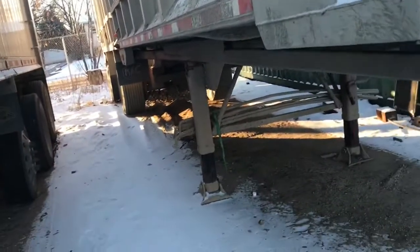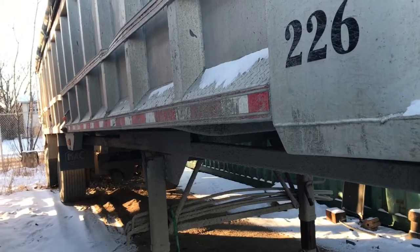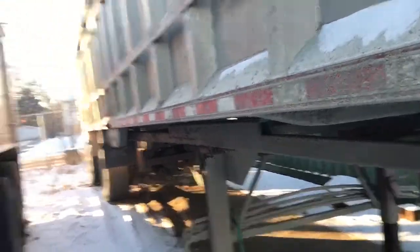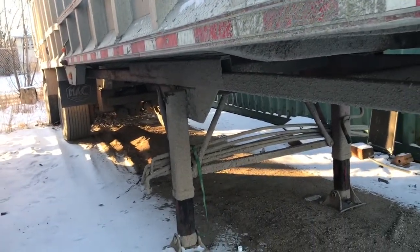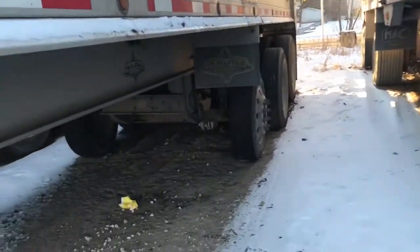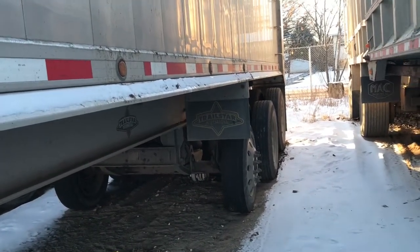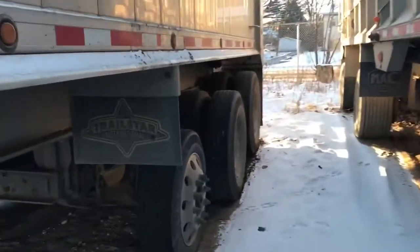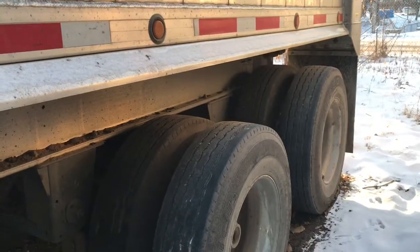They're used for different things. A lot of times frameless trailers are used for more, they're lighter, so we use both of them for ton hauls, but the reason that we use the frameless if possible is because they're lighter. Frame trailers are handy for when you're dumping on unstable ground, which you shouldn't dump on unstable ground anyways, but if the ground's a little bit soft, all the wheels stay on the ground while you're dumping.